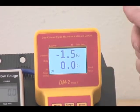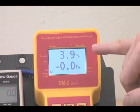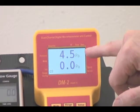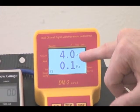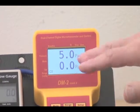On this gauge we now have that baseline pressure in memory, and it's subtracting that. So before we were getting an 8, 9 pascal pressure, and now we're getting a 2, 3 pascal pressure, but it's been reduced dramatically — we're subtracting our base pressure from the pressure reading.